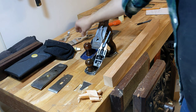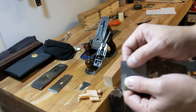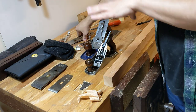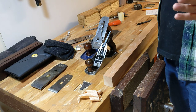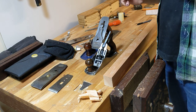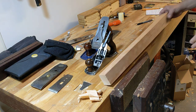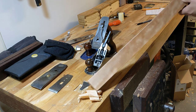But a lot of people will tell you you don't need to worry about the cap iron - set it back a quarter of an inch, it's not going to matter, they don't work for controlling grain. And even the term chip breaker is somehow offensive - it's a cap iron and you must call it nothing else. Though in a strange way, although I do call it a cap iron myself, chip breaker is kind of closer to the description.